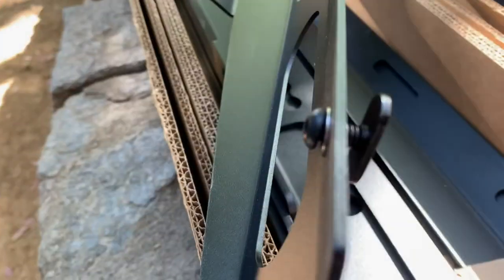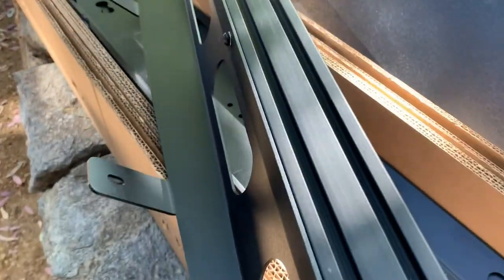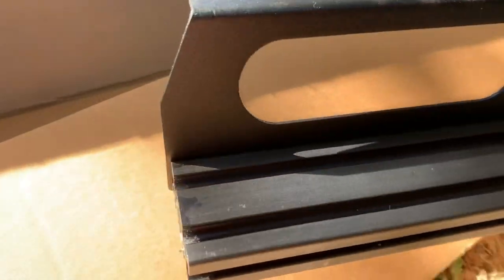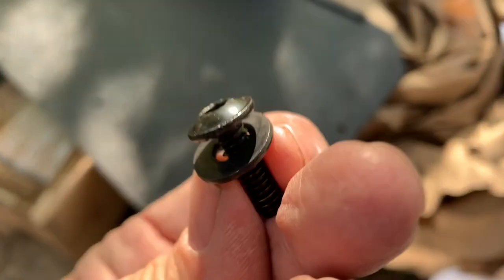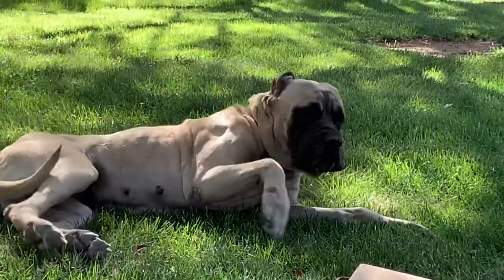I had a couple of moments where I thought I better call a professional. You put these bolts through the fairing assembly on the inside and then that T-nut on the outside, because we're going to slide some 80/20 on there. See how I'm sliding the 80/20 onto the fairing assembly — that's where those T-nuts come into play. The bolt heads are inside, all the way down. Keep everything loose so it'll slide into the track. That's how you marry those two together — it's genius. These are the quarter-20 flange heads with flat washers and nylock nuts.